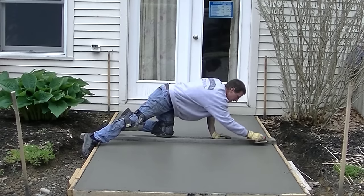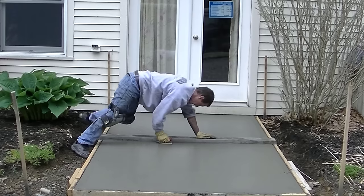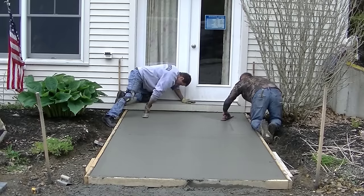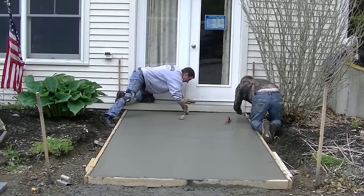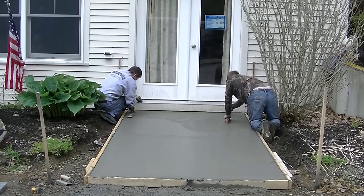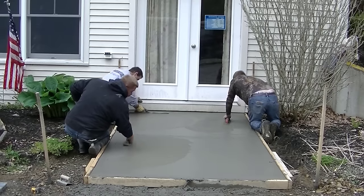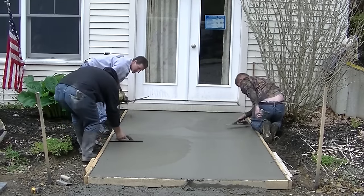I actually let the concrete set up a little bit more after edging, so it's firm and holds its shape really well, but you can still see how easy it is for me to joint that in a wet mix concrete. In a dry mix, I don't even think I could create a really nice looking joint like this — you'd probably have to saw the joint in afterwards. I've done this for a long time and I've even done a dry pour mix, so I know it's very difficult to cut a joint like that. Versus when you have paste to work with — right there I'm scraping up a little bit of paste off the surface to fill in a tiny void. When you have moisture and paste at the surface, you can mag float the concrete and get ready to put a finish on it. This one we're going to put just a light broom textured finish on, with the picture frame look using the edger and groover mark in the middle — a much more enhanced look than just a basic sand finish from a dry pour mix.